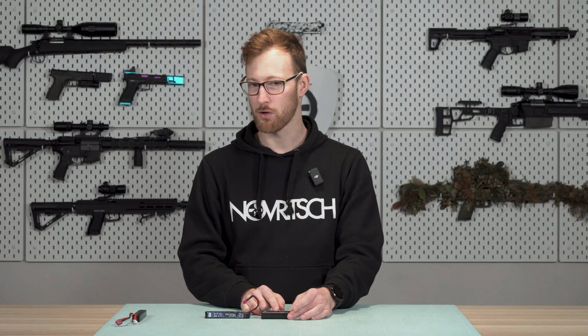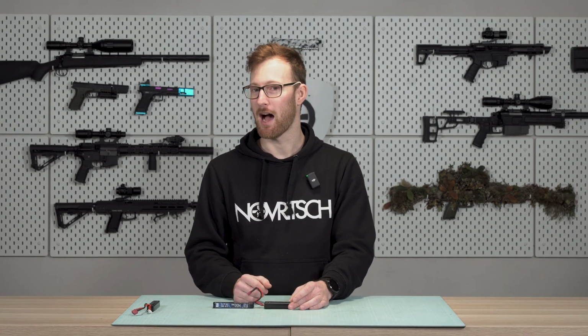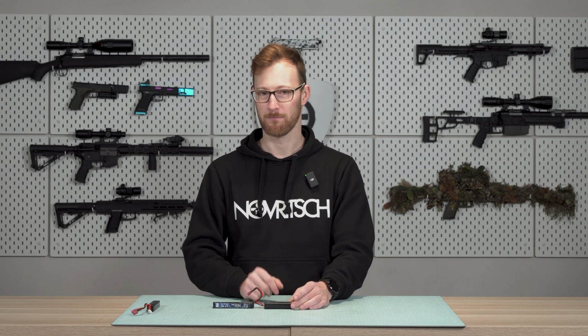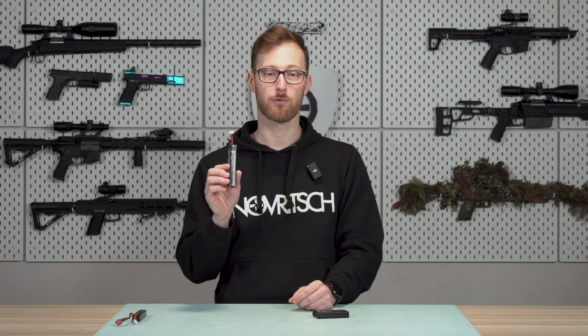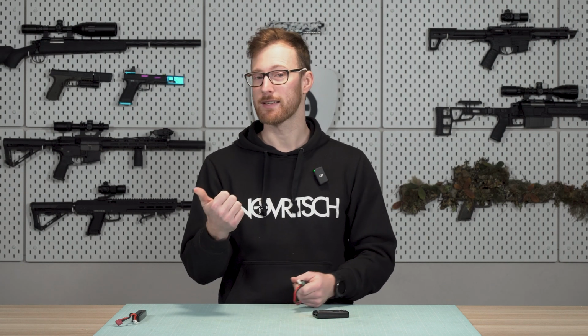The threshold that I was talking about was 0.05. This is just as high as it can really get, which is a 100% indicator that, okay, this is wrong, you should not be using this battery anymore. That's how you troubleshoot, or that's how you check whether the battery is healthy. This basically includes all the different options, whether it doesn't detect the cell at all, or the voltage of one cell is just 0, or you can use the minimum and maximum.